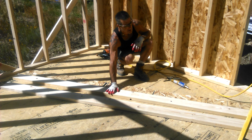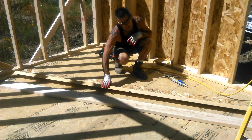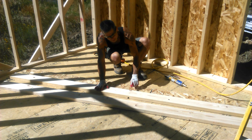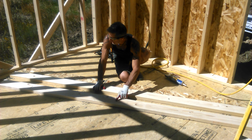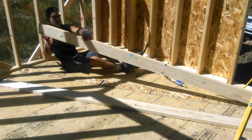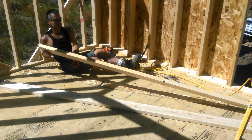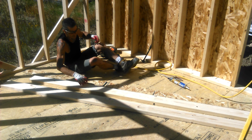What you do is you take your wood — whatever wood you want to make a beam out of — and you crown it. All that means is you want to find the banana side, the bow side up. You see I drew a simple picture here: I looked down the wood and found that it bowed upwards. You want to make sure you get that side up so that your beam will take weight correctly.